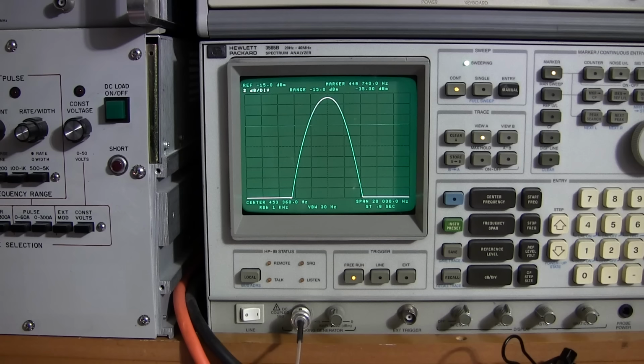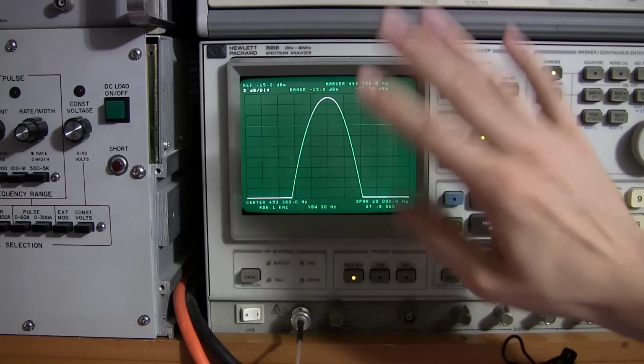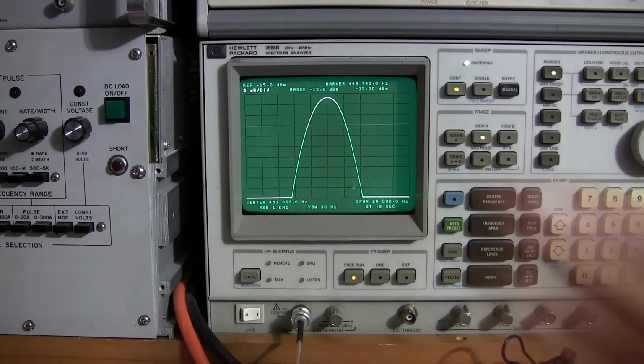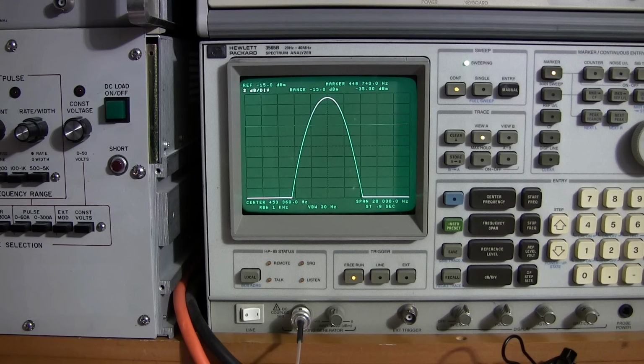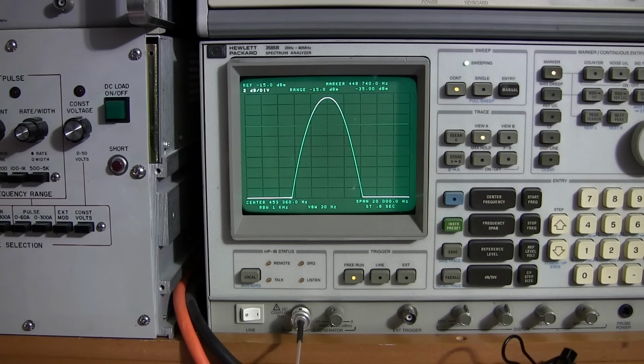Now, that's not really something to be worried about, because if you're ever going to try and narrow in on a frequency or some channel, you'd probably click this over to the manual mode and turn the sensitivity down. Or if you're trying to narrow into a CW signal, this will remain centered. So in the manual and the CW mode, this remains completely centered. If you're going to run it on AVC, it's going to shift a bit here, and that's not really too important because it is in the AVC mode and it is a wider position. It also widens up the actual curve here, which is really nice because it'll make for comfortable listening in the AVC mode on AM. Now, keeping this looking good in the AVC mode is a bit of a trick, and there's a slug that really affects that in one of the IF transformers here, and I'll show you which slug that is.